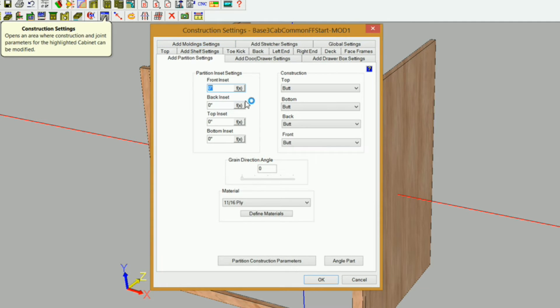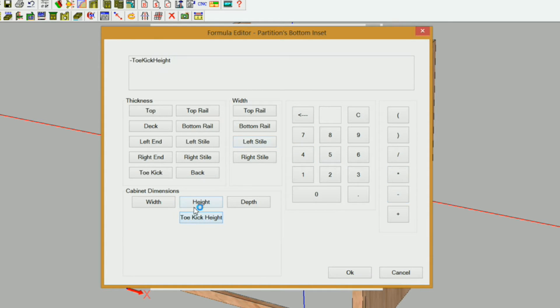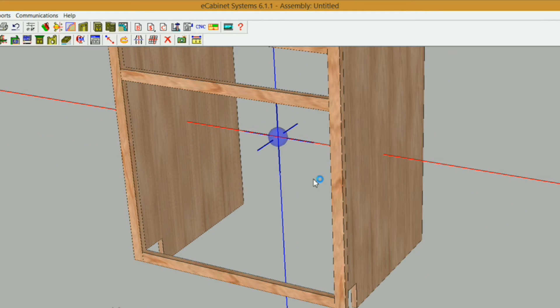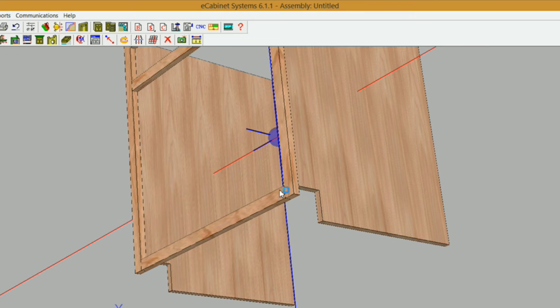Under add partition settings, I want to make sure the bottom of my partitions extends down by my toe kick height. So I'll go to the bottom inset formula editor and enter minus my toe kick height. Now you can see how the styles extend down past the toe kick by the width of the bottom rail. In this case I cannot use my bottom rail at all because I'm using fixed shelves, and I want to associate those fixed shelves — which are going to be my decks — to the top of what's going to be my bottom rail. You can't associate fixed shelves to your bottom rail or top rail, and you can't associate partitions to your left or right style. For that I'm going to use a mid rail.